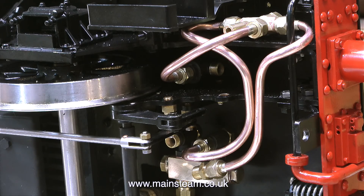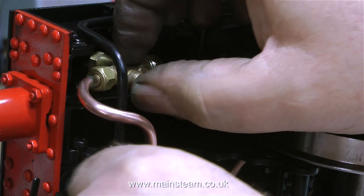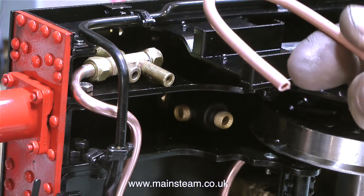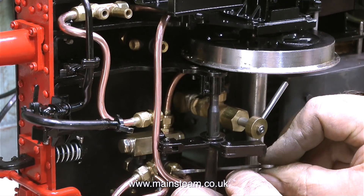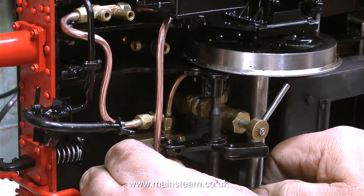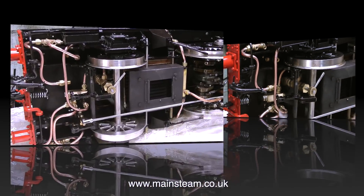It's very fiddly, quite frustrating, but very satisfying when you get it in the right place. I don't think that looks too bad. I'll make some slight adjustments once everything's in place — you can see there's a steam inlet, a water inlet, and then an outlet to the clack adapter underneath. So that's one side done. The water link and the link for the steam inlet pipe are identical on both injectors, and I made all of these in the last episode. Moving to the other side now — the first two pipes are fine, but this pipe is entirely different as it has to go to the second check valve. I often use a felt tip pen to mark the position when bending pipes in situ.